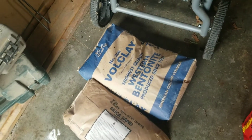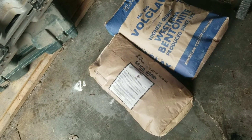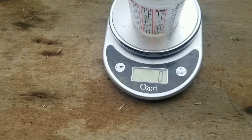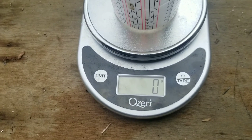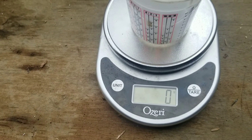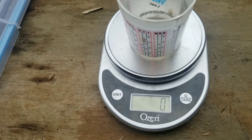I'm going to add either 10 to 1 or 12 percent bentonite by weight. I'll put the cup on the scale and tare it to zero so it doesn't incorporate the weight of the cup. I'm using grams even though I'm in the United States — I think it translates well since a lot of people getting into this end up learning some metric. So I'm going with grams and kilograms, targeting about 12% bentonite by weight of the sand.